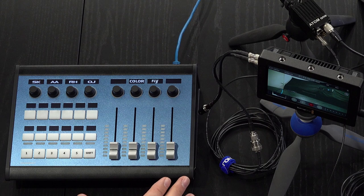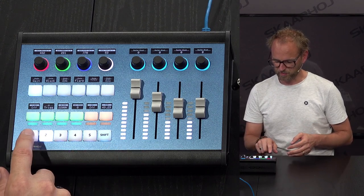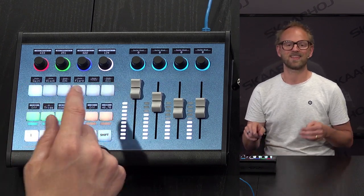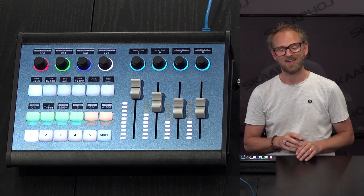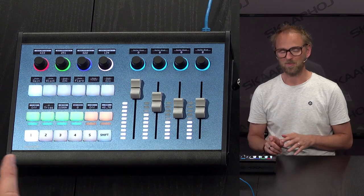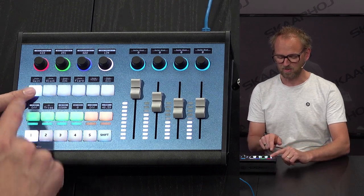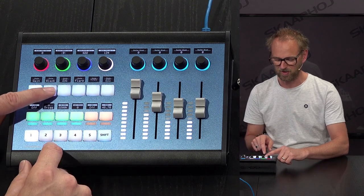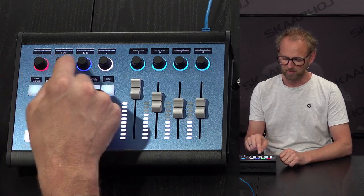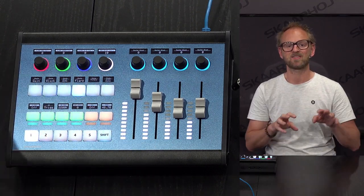The ColorFly is now booting up and connecting to the cameras — and there you see the fader move into position. I can choose between camera one and camera two using the dedicated buttons. This row of buttons has been assigned as the menu selector, similar to the RCP. Since we have half the knobs but twice the buttons compared to the RCP, the mapping is divided: a gain menu gives access to red, green, and blue gain and ISO; the black menu gives center black, red, green, and blue, and fast gamma; and then black master, red, green, blue, SDI white, SDI black, and flare settings.